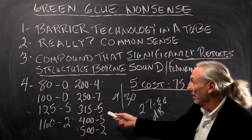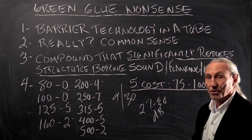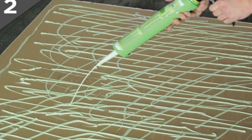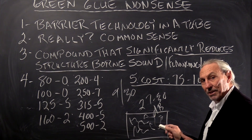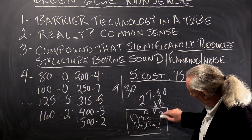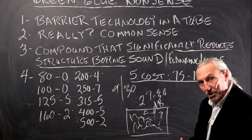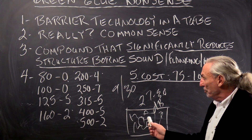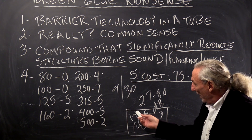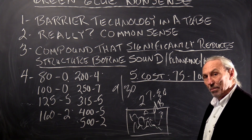Using common sense, this is basically glue — it's an adhesive. If you also look at their website, they show an example of how to apply it. So we take a 4x8 sheet, and they've got it all over the place — no uniformity or consistency in application. Just squiggles, lines of glue everywhere. So when you put those two sheets together, it's supposed to seal completely. There's no way. I've been building buildings for 40 years. There's no way this seals, no way with this kind of pattern that you get uniformity and consistency where there would be no openings for sound to get through.